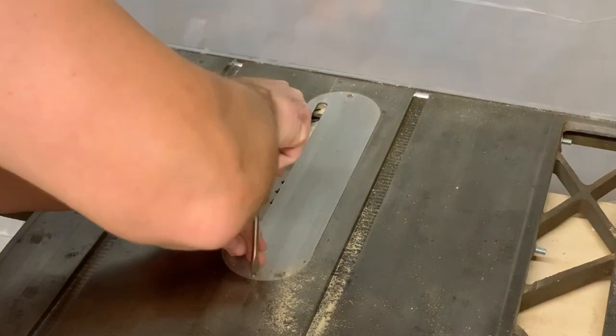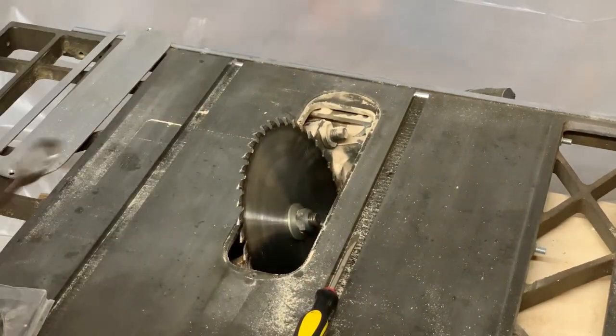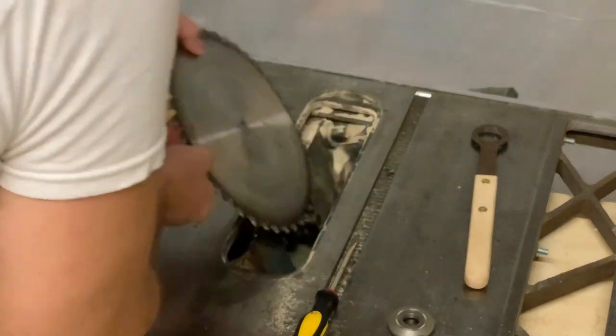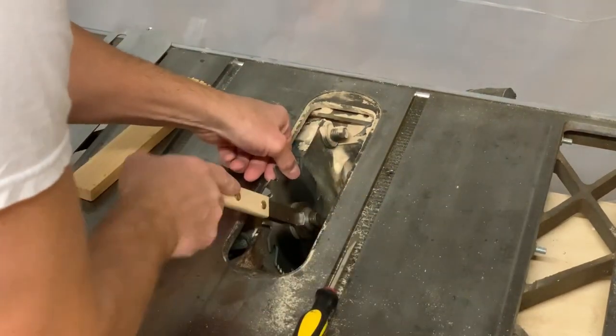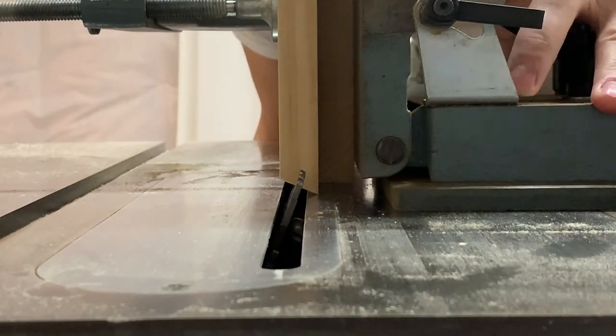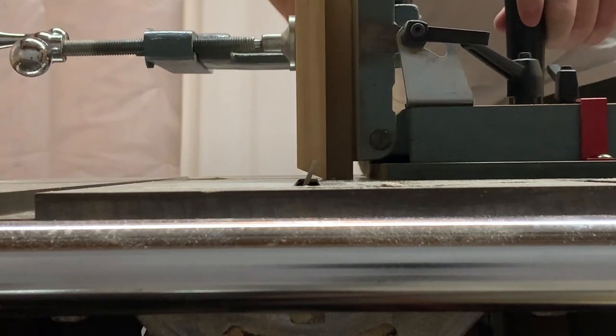So I sent him my reply. Hey Felipe, I see how it is. I think you're just worried about all the awesome that's happening over here. Good luck to you buddy — you're gonna need it. Enough shenanigans. It was time to start making my joinery stand out. I decided to use splines to join the sides together, so I switched out my blade for one of my dado stack blades which cuts a flat kerf, all the while making sure to leave the angle set as is. Here's the cool part about doing angles like this: flip the side over then stand it up on end and you've got yourself a perpendicular spline dado. Geometry for the win!